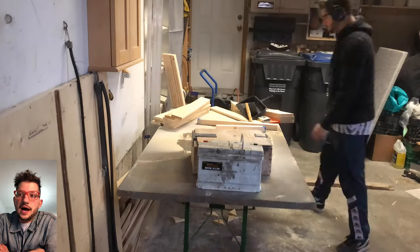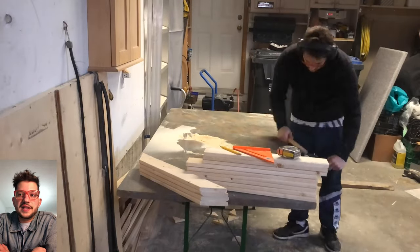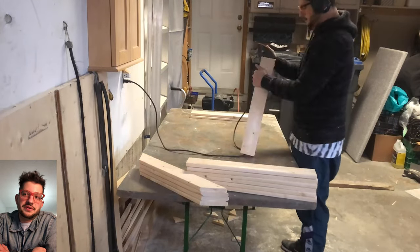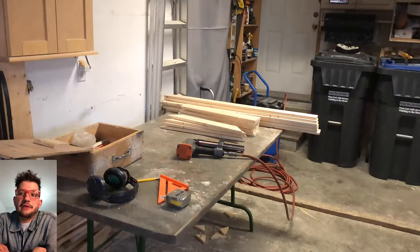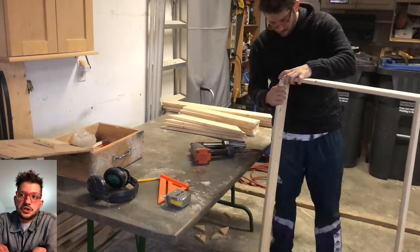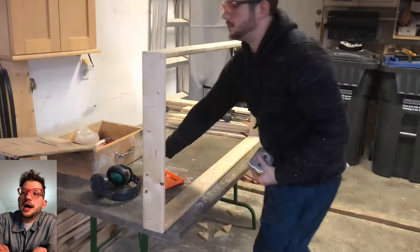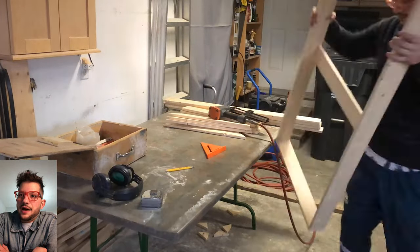This is not a full fully-filled bass trap — we do offer that for clients at a higher price point, and it's a more permanent solution. Some clients like things to be modular, some like things to be on the cheaper side. For this particular client he wanted things to be very modular and to be able to take everything with him to another location at a later date. That is why rather than doing fully-filled bass traps we did these four-inch-thick corner panels built on a 45-degree bevel.